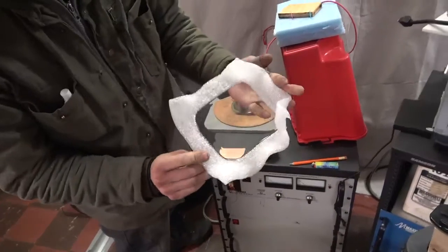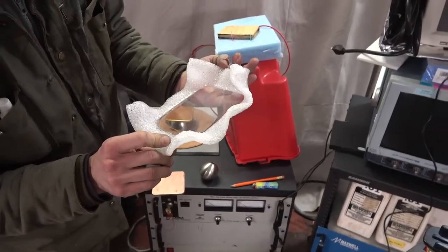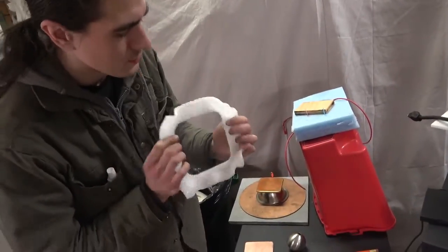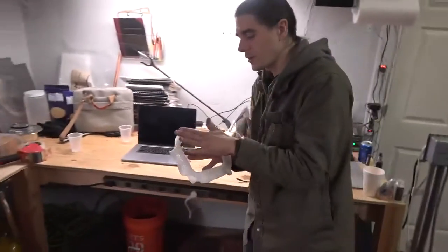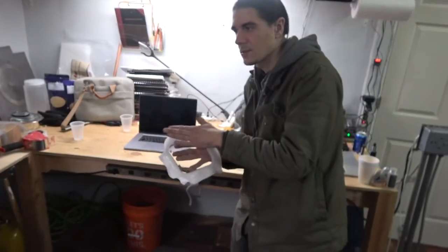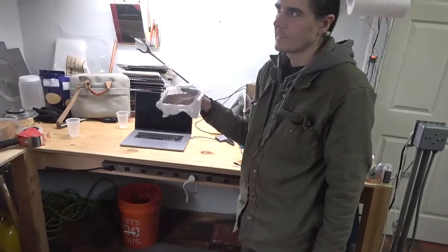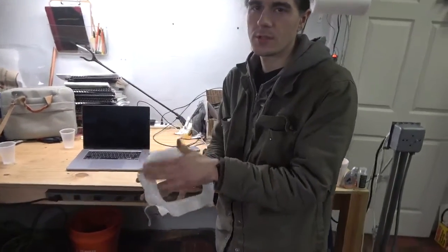You can see the profile of the pieces that were set at the electrode plates. The big question is: was this actually hot enough during the making of this electret? That's one question we do not have an answer to yet. But supposedly we should short the plates. There's plenty of static on there — that's a good sign. It is remaining charged. There's more static on the surface, so this is a good sign.